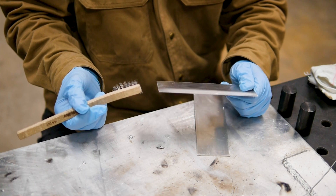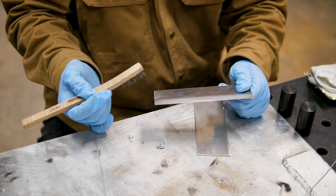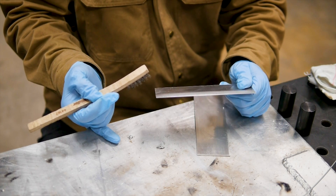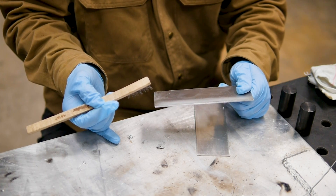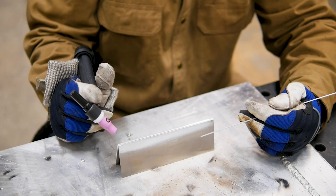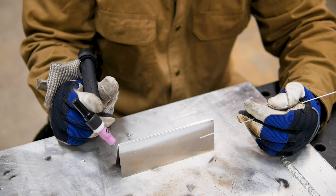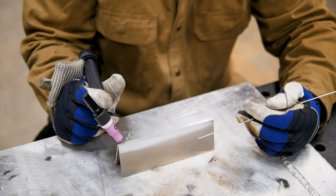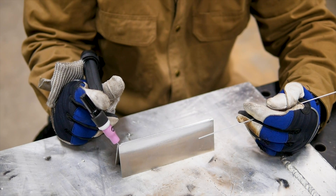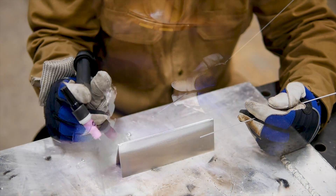With this really thin plate it's very important to remove that aluminum oxide, because by the time you get enough arc energy to pierce through the aluminum oxide, the aluminum underneath is vaporized. I've got my 14 gauge aluminum tacked. The tacks are slightly inset because I don't want to blow away the edge of my plate. I'll light up just after that tack, then roll in and catch the edge of it, and then complete my bead all the way to the end.